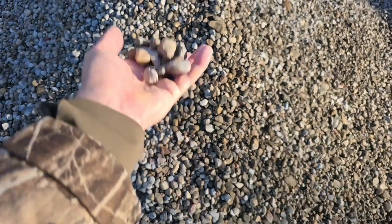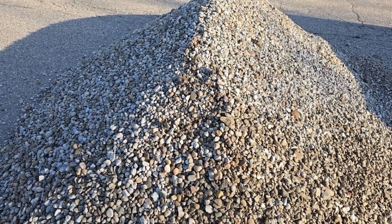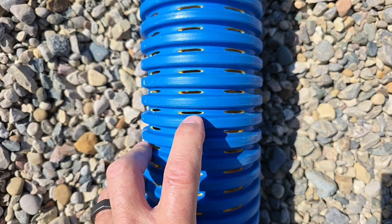This system is going to move a lot of air, so the system dries out quickly. We don't want the system to always be saturated because tree roots love that. If you can dry your trench out, you can keep the tree roots out.